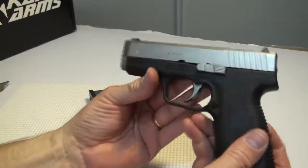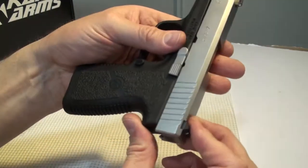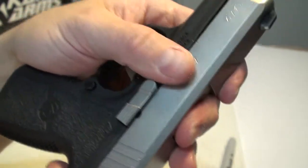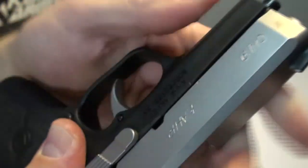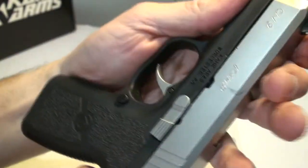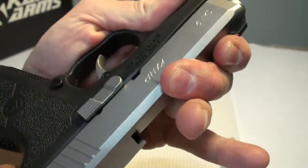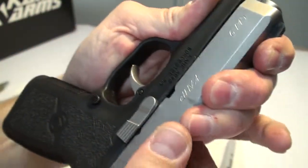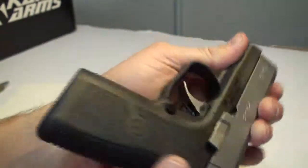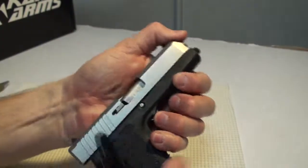So the simplest way that I found, or the best way I found, is first rack it. Okay, and that just gives a little less tension on the spring for some reason. Now we can pull this back to where those 2 notches line up, and while those are lined up, it's hard to do this with the camera angle. While those two are lined up, we can now push the slider stop from the back side, which is this pin right there that goes all the way through. So we're going to push it with all my might. And I got it started, which is fine. Now you just take some kind of blunt object, just pop it a little bit more.